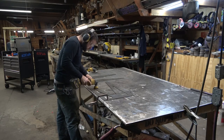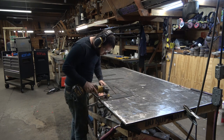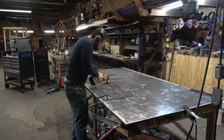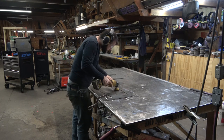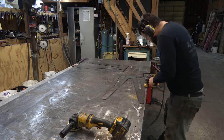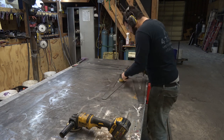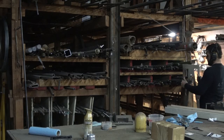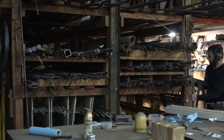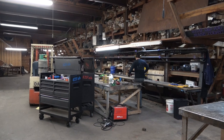So let's go back in time a little bit to my shop. I actually don't have the footage of me plasma cutting these pieces out, but we get them cut just like I did at Maker Table. This is out of 12 gauge steel — probably could have gone to 10 gauge, but for what it is, these are pretty strong. We're going to clean up all the edges, just wire brush them down. Then I'm going to run over to my scrap pile and check if I have a piece of pipe that matches this inside radius pretty well.